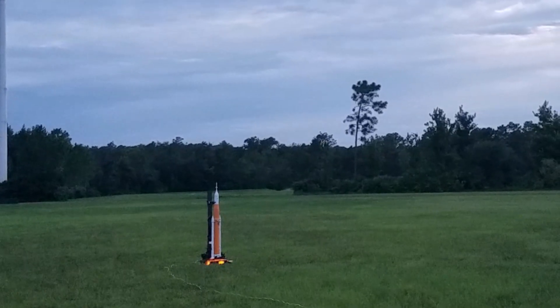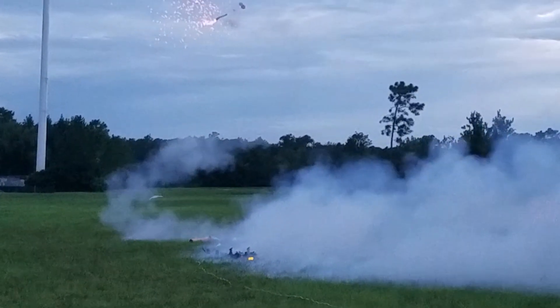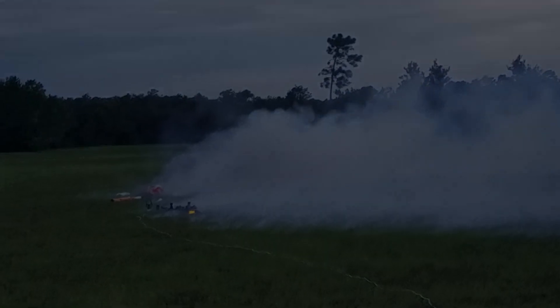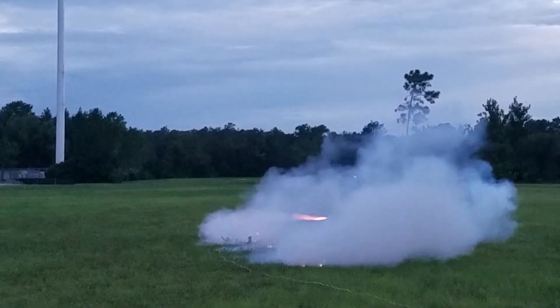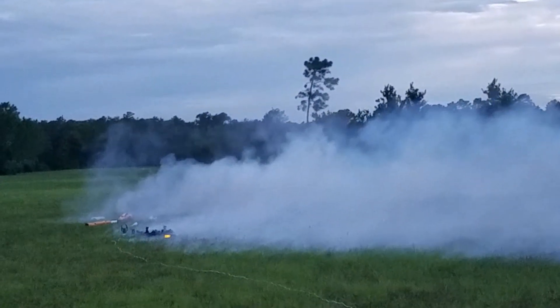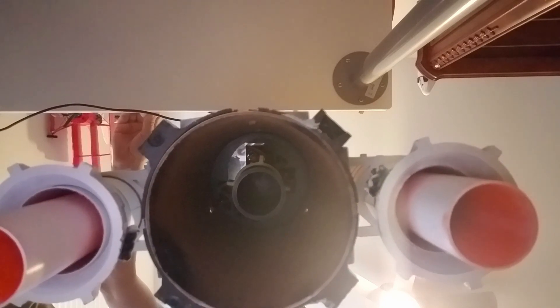Then we have a strong back retract, and once the strong back begins to retract, my nearest guess is it begins to take the whole stack down with it. The vectoring system is unable to compensate fast enough because the rocket is still held down. As it begins to fall, it slips out of its mounts and we see it go almost all the way sideways, and everything just kind of flails violently until the boosters find a way to disconnect. Eventually the smoke clears and one of the side boosters takes flight until it pops the parachute — so that worked alright. After investigating and dismantling the vehicle, I found that the thrust vector system in the booster is wholly inadequate to withstand the actual thrust. The single steel screw that goes through the length of it seems to have broken the structure inside of the 3D-printed mechanism, so that's a definite no-go for the future.